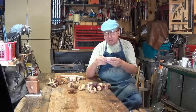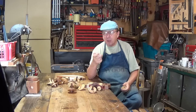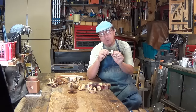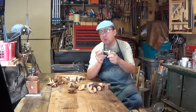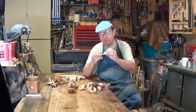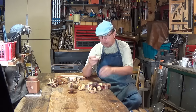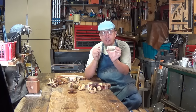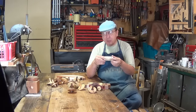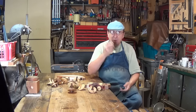What I do is I have a little holder here. It's just a piece of plywood, and I use 5/16 axles, and then I use a little end cap. I can put this end on the headstock to my spur, and this end to my tailpiece. So I just mount my four blanks all at one time. Then I put my little end cap on here, and I spin four at a time. The end caps work just like bushings if you're familiar with pen turning. They tell me what size to make them, how far down to turn them. And it works out pretty good. So I'm going to show you how I made this.